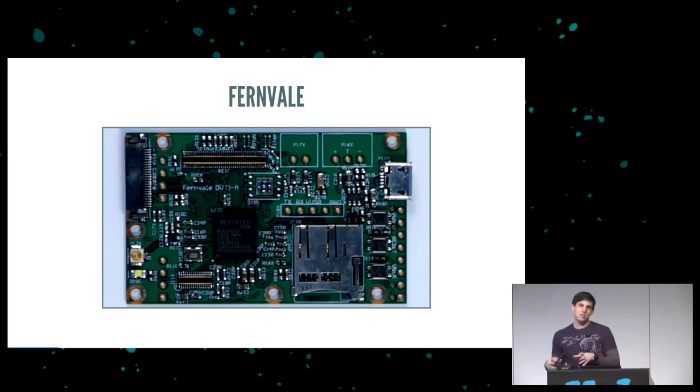Towards the end of the development cycle, we got USB support working natively. So all you had to do to develop on the CPU is plug it into the USB port. It had power. It had USB serial communication, and it was really easy to bring it up. This actually surprised me, because I have the serial cable set up, and I thought that was relatively easy. But just having USB serial made it so easy for other people to get going and start contributing code that it really stuck with me: USB support on a thing is huge for enabling users to use your product.